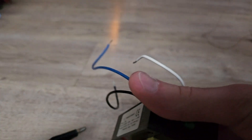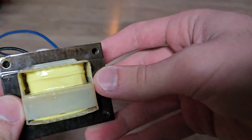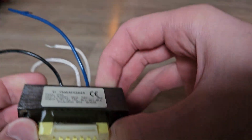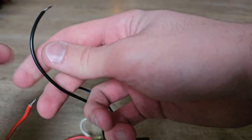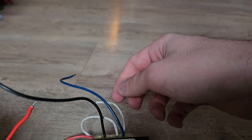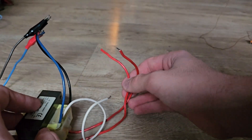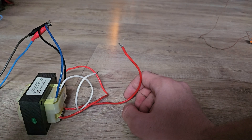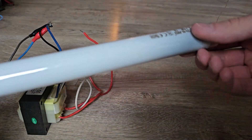This transformer is actually really small, but it's funny to me — it has this design like the bigger ones but it's really a small one. Now I will wire it to my amp and I want to measure the voltages — first at low volume, then at higher volume. As usual I will use 60 Hz. But first, here I have this lamp.